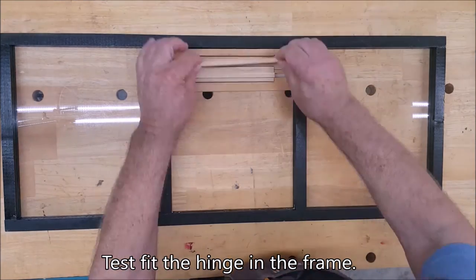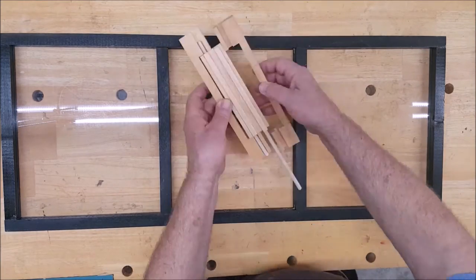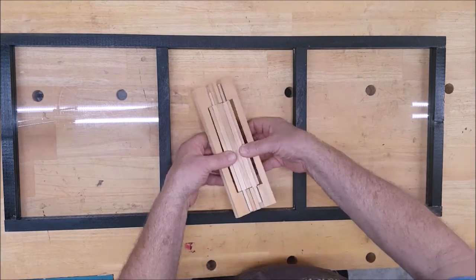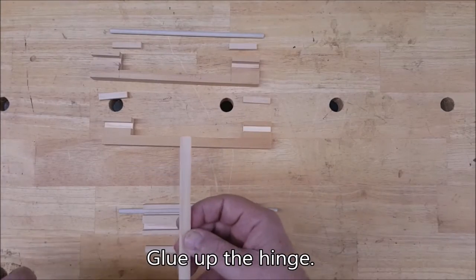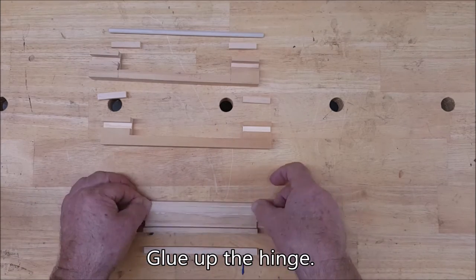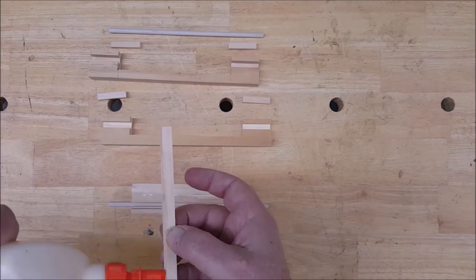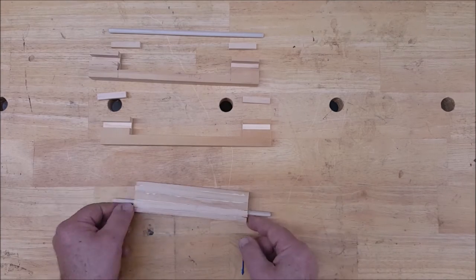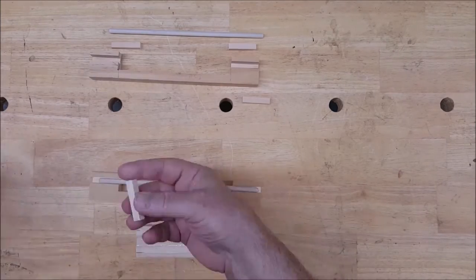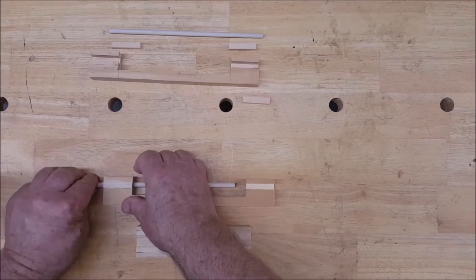We need thin strips of wood to fit in the grooves and close them up after the dowels are in. These are going to wind up being 1/4 inch by 5/16 of an inch, but they can be rough cut to start and sanded down until they fit. You don't see me cutting them in the video, but you'll need to when you build your cat window. You saved those little scraps of wood from your last project because you knew you'd find a use for them someday, and that day has arrived.